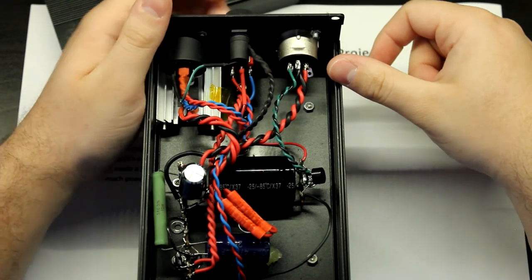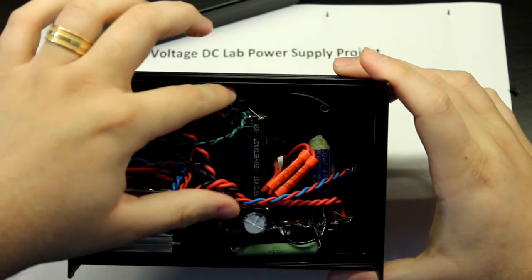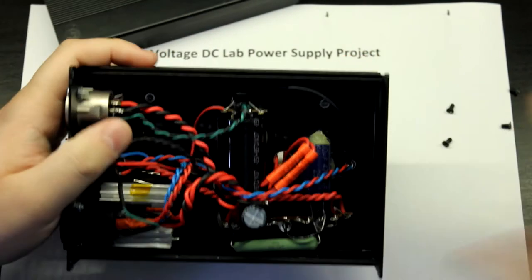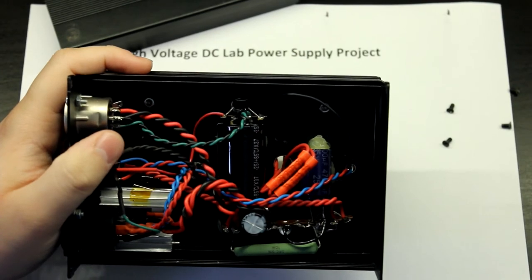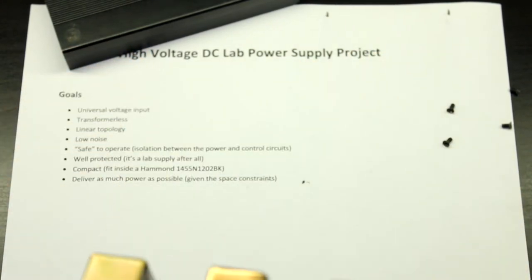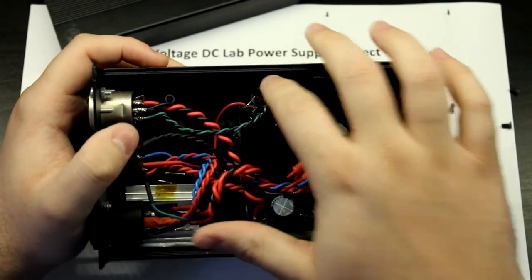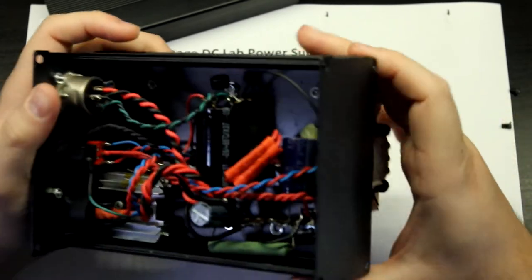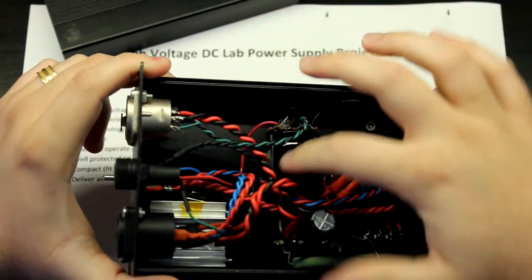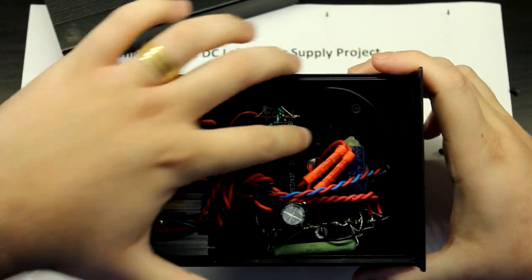It just goes to the selector switch, which then goes to this terminal post here with a bridge rectifier. I think that's a bit difficult to see, but hey, there is a bridge rectifier down there. Let me see if I can put something behind it. Yeah, there you go. A little one of those. I think it was a W10M bridge rectifier into a very big capacitor, and oh great, the markings are on the bottom and it's hot glued into place and it's not going anywhere. Oh, I used some nice hot glue this time at least, but yeah, it's down there.